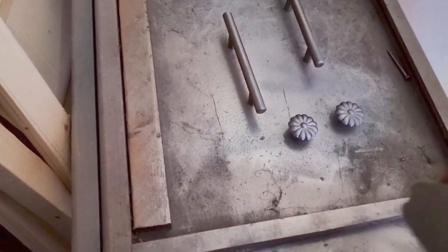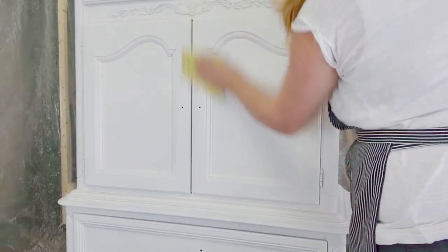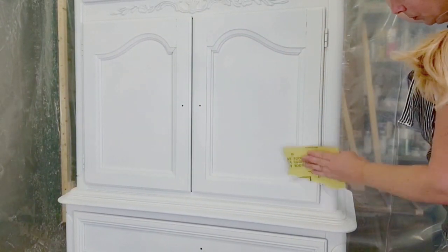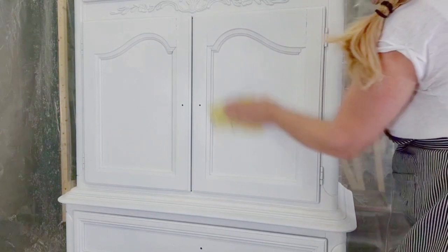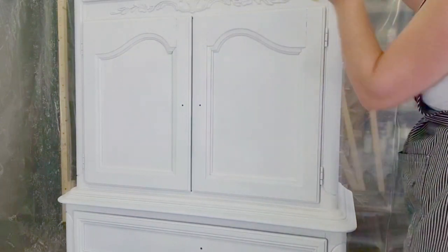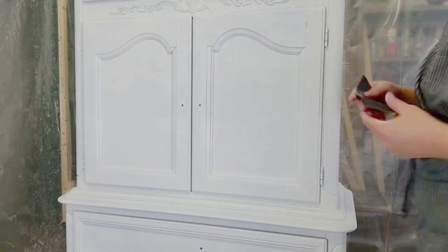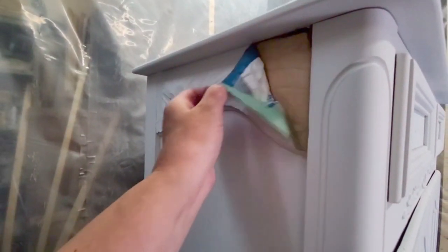I had two bar handles and two original flower knobs for the drawers, so I got a little bit of modern and a little bit of the original look, so that the flower knobs match the scroll appliqués on the dresser. I'm getting a bit of both. I'm spraying the hardware with Rust-Oleum spray in silver on a board. Then I ended up changing the hardware color and going with white — you'll see that later in the video. After the first and second coat, I sand in between every single coat with 600 grit sandpaper. If you have a 1000 grit sanding block that's even better, but 600 will do — that gives an even smoother finish.